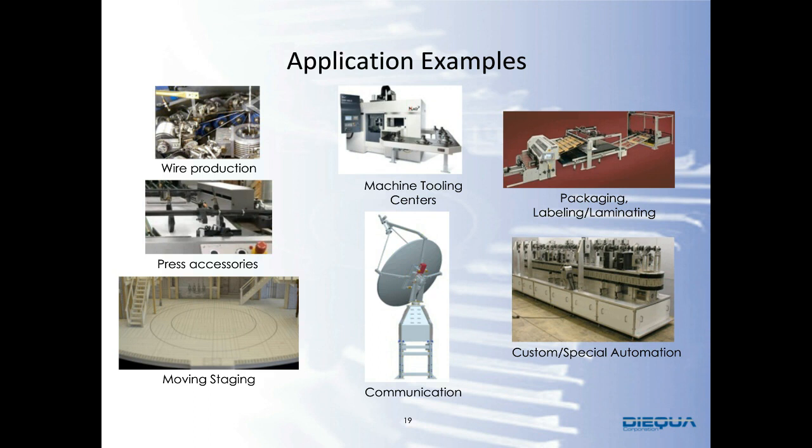In these applications, whether it was press control for performing cutting or edge alignment, repeatability and getting to position without having backlash become a consideration, our Dynabox lent itself well. In the communications application, torsional rigidity and backlash control was also a major consideration. Also the non-back drivability. The dish needs to be held and locked into position. That product lends itself well.